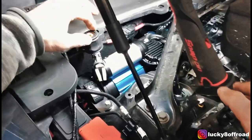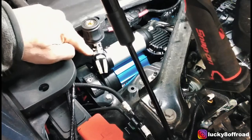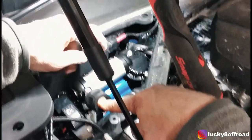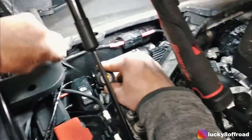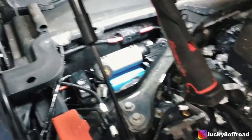Quick recap on how we're putting this together: quick release at the top, adapter piece in the middle, pressure switch also to the middle. I offset it a little bit — it'll lay down in this area, be away from the strut tower, and allow you to still access the quick fitting. You can put it any which way you want; I just like the wires tucked out of the way so when you stand back it looks a little cleaner. When you've got everything where you want it, take your 10mm wrench and tighten down the outer bolt to secure everything. Pay special attention that this quick fitting is not higher than the plastic area around it, or else you will smash the hood when you close.